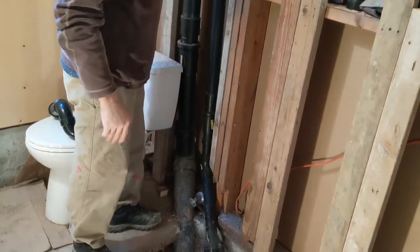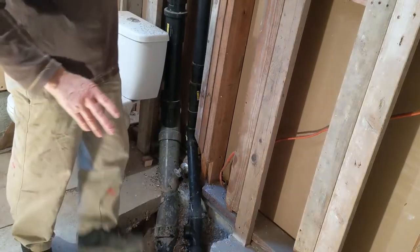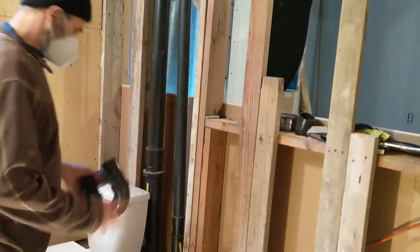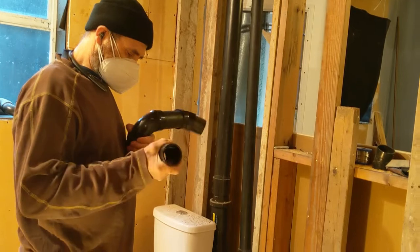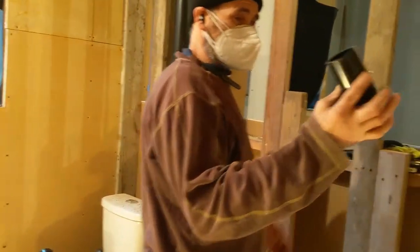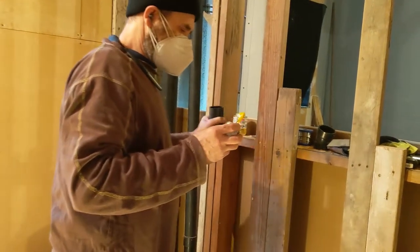We are good here for the pre-fit. All I want to do is just pre-fit this pipe, then once I've checked the shower to see if it's gonna fit perfect, I'll glue everything together. This is more or less what I have for the drain of the shower — I have it more or less cut. This one here doesn't make a difference because it's a straight pipe, I can glue it on right away, even before I bring it down.